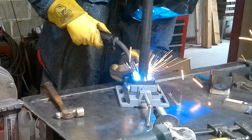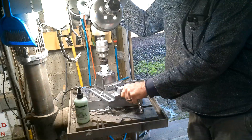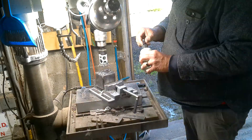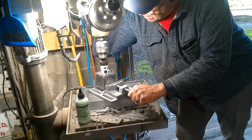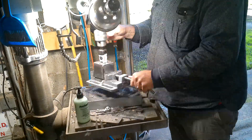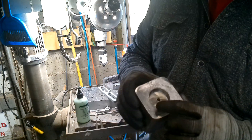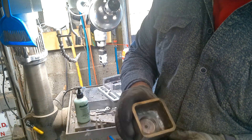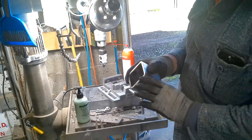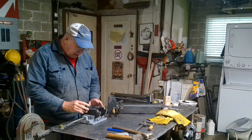This green stuff called Anchor Lube — I'm not sponsored by them — I recently discovered it and it really makes a difference any time you're doing cutting, like using this hole saw to drill out that 3/8-inch plate. Now there's a place for a thrust bearing there, and the thrust bearing there, and a 3/8-inch plate in the middle we're going to have to bore out to 3/4 inch.